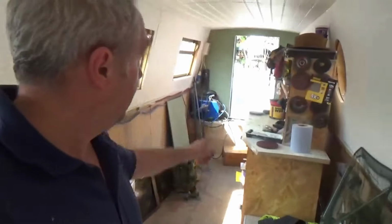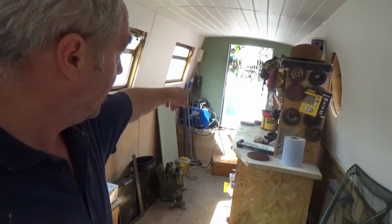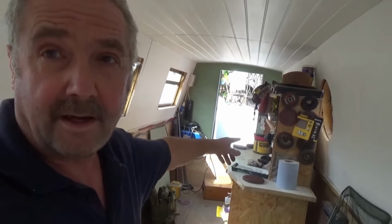So out there we'll do the deck, the main deck, the walking bit. Under the side steps and the side steps, I'm just going to get all them done because you have to leave it like 16 hours before you can put another coat on. It says you have to use two coats of it, so I need to get that done now because it's my last chance for 4 days to get anything done on here because I'll be away. So I want to get that before I go away